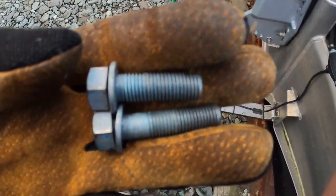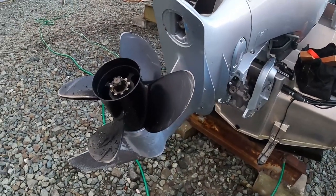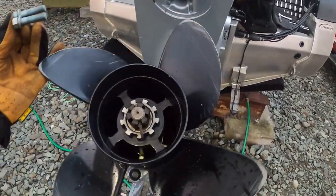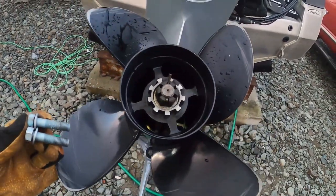The trim tab is off and it is the short bolt, so when it comes time for reassembly the short bolt will go here. Right in there is the other bolt that's hidden, so I'm going to grab a long socket and get up in there to get that one out. That bolt is now out — the recessed one under the trim tab is the same bolt as the rest, nothing special. I was able to do it with the prop still attached, which is great because I don't really want to mess with pulling the prop here. I'll do that at home to check for fishing line and regrease the shaft.